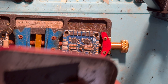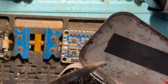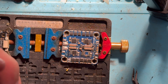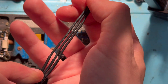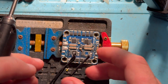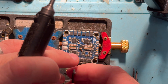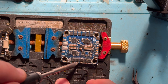Again we're gonna clean the tip, make sure everything looks good. Got our motor wires. If you're not familiar with this, the motor wiring order really doesn't matter — I just like to keep it straight for aesthetic reasons when it's on the arm. Then I verify everything in the GUI on the computer, and if I need to reverse a motor I do it in there. So let's say we're gonna use these three pads right here.